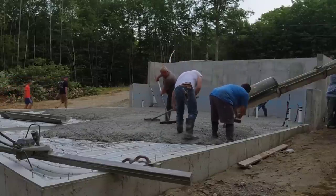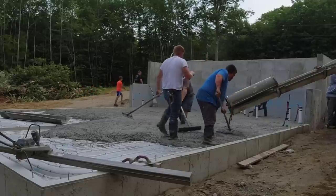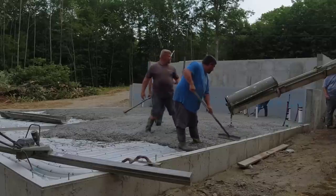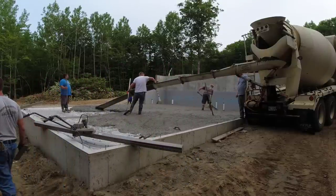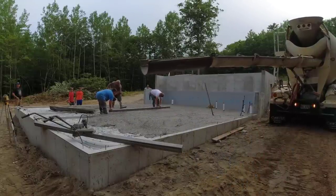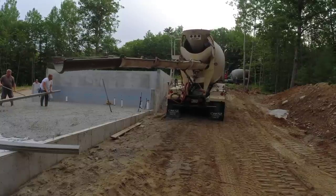You see that slump? It moves around pretty good. It's stiff enough to hold its shape really well, but it's loose enough to push and pull around so you don't really kill yourself. That's what the water reducer does for you. I've got many videos on that. I'll link one down in the description so you can check out exactly what that water reducer is, in case you guys are wondering about it.